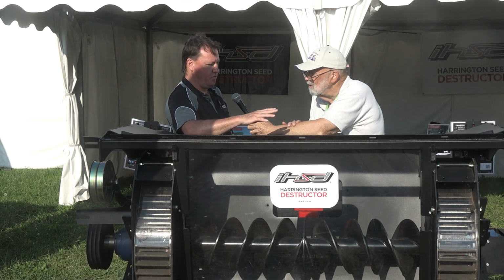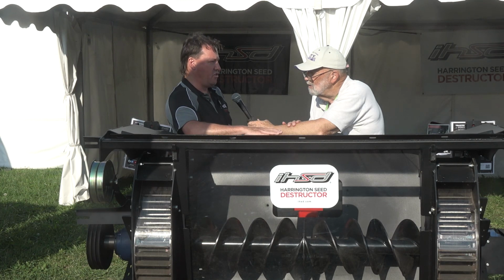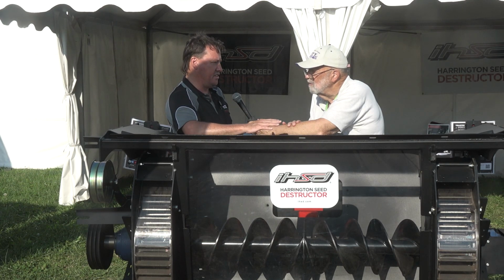Okay, now, probably 95% of the folks watching this or listening are going to say, does it work on both corn and beans? Yeah, so we probably recommend that you target your weeds in beans. You're going to pick up more weed seeds through that process, whereas corn is a bit harder on the mills. We'd probably say that you're better off in terms of mill wear and damage to the mills running in beans and drier beans, so food grade beans we think are going to work really well.